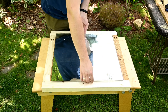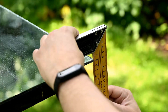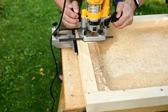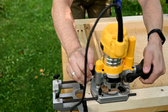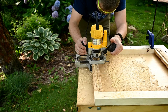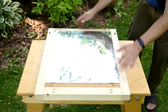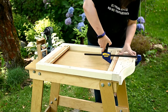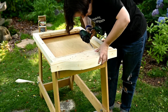And here is where the mirror appears. To install it into the frame, you need to make a recess on the inside using a router. Gary helps me with this — I'm still afraid to use a router myself. He makes a recess equal to the depth of the glass, which is five millimeters thick. The width of the recess is different on all sides — wider above and below, and quite narrow on the sides. The top curvy part has dried and I'll install it. I'm clamping the part to avoid wiggling and fastening it in place using a pocket hole connection as well.